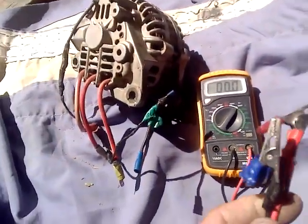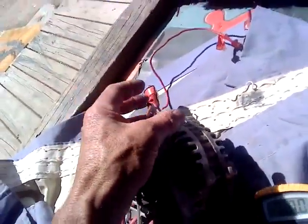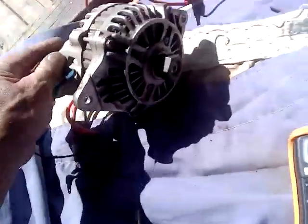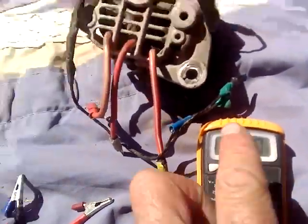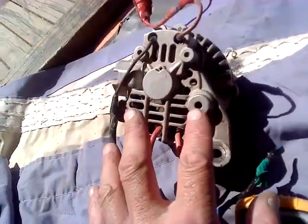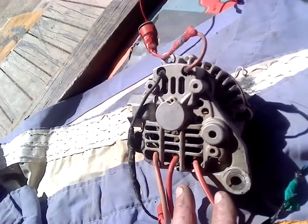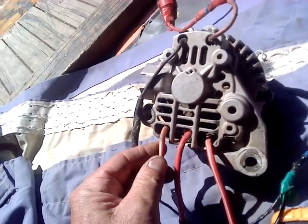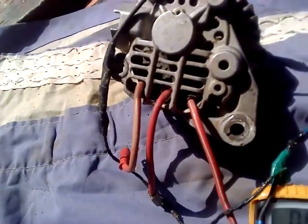Now these meters, they only measure 2 pins. So if you put 1 here and 1 here, you spun this up with 12 volts in this thing, creating the magnetic field in the center, you'll get AC current coming out of here. You spun it up by the drill from here, right? So what my other video was going to be about was, okay, you could only measure 2 pins, there and there. And just say I put 12 volts here, I spun it up, I measured the power coming out of 2 pins, it measured something like 24 volts. Okay, half that for a minute, half that. That 12 volts is the other pin. Do you get that? That's what the other pin would be if you could measure the other pin. So that's 24 volts plus 12 volts is your 36.